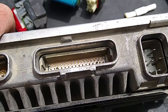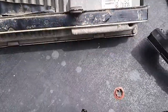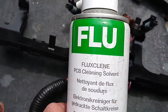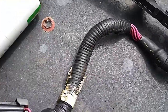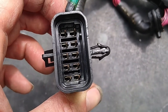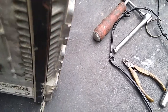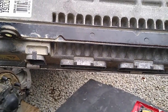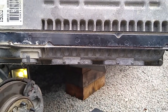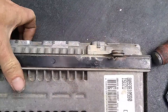That's all you've got to do and that'll clean most of that rubbish out. Also use the Fluxiclean or PCB cleaning material to clean the connector out here too - that'll clean all that oil out. Take it like this one here, turn it upside down, and spray the cleaner up into the connector so it all runs back out. That will get rid of all the rubbish off those connectors - it's probably recoverable at that point. This one has been cleaned in the past and it's fine.